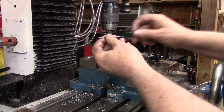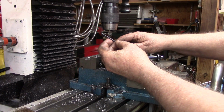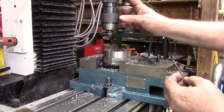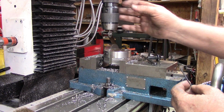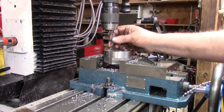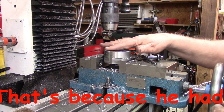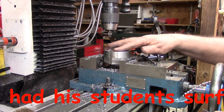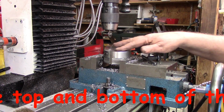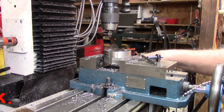All right, I looked through my miscellaneous drill bits and actually found a 7/64. It's what I was missing in that smallest hole. I changed the chucks out; this chuck will go as far down as 1/32. So I drilled that hole out, and Mark doesn't call for any kind of a countersink on the drawings. But off camera, I'm going to go around through all the holes with a countersink and just clean that top edge up a little bit.